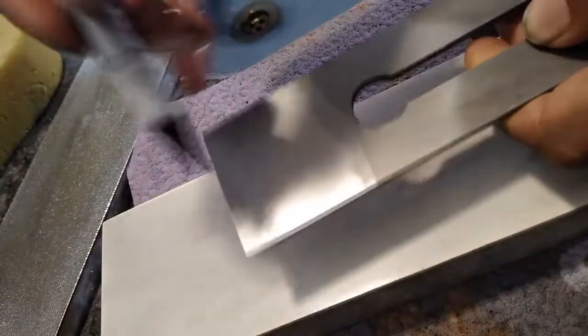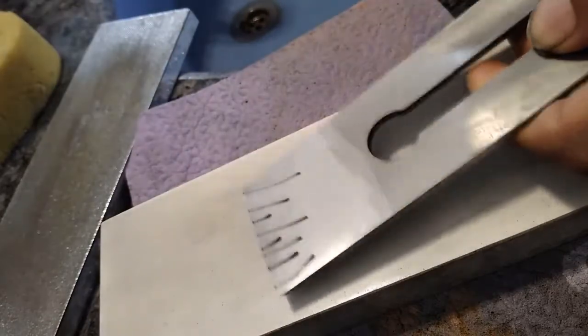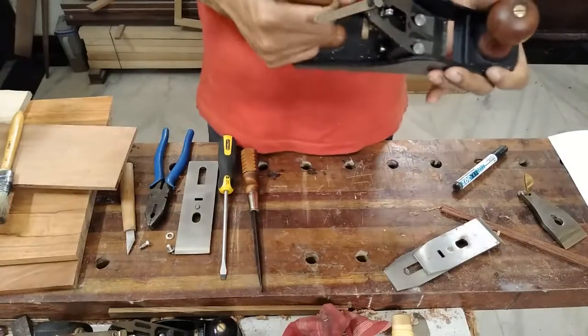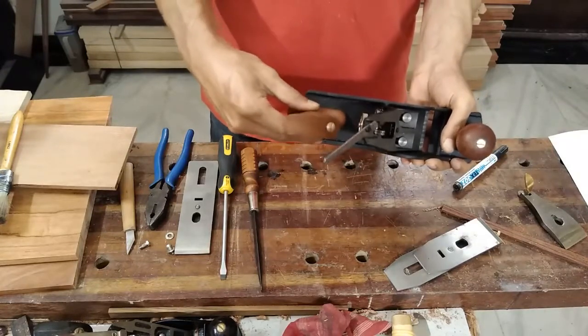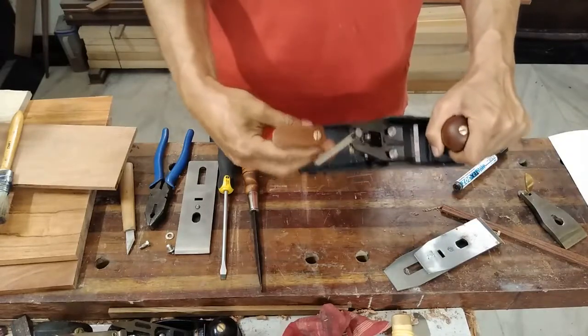A major problem was the blade. It had been ground badly. In order to properly hone a blade, the back has to be flattened perfectly. In this case, I found a large hollow that took hours to level. In the end, the tip remained low, which is far from ideal. Among the many small problems with this plane is this rattly handle. I've tried everything to tighten this, but it just doesn't work. So you have this absolutely annoying feature over here, which I don't know how to fix.